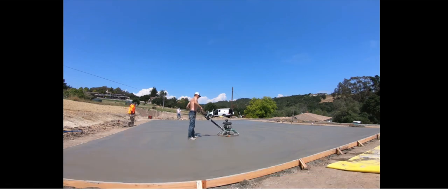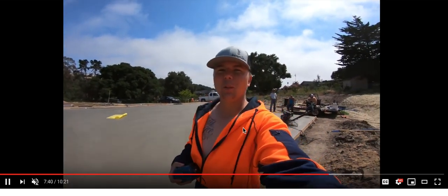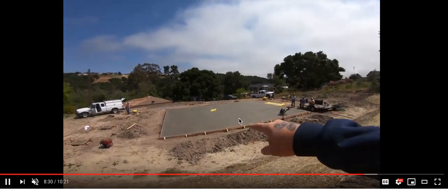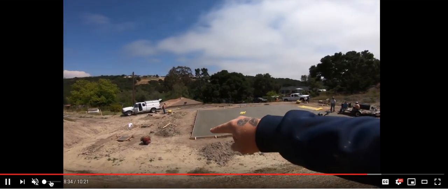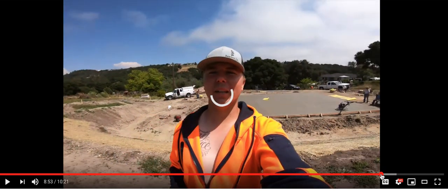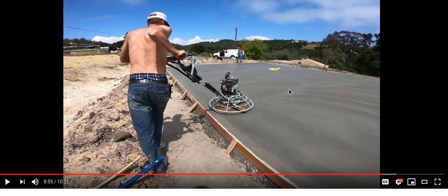At the very end, he's going to add water and trowel again. I'm like, whoa — what are you doing here? That's a good way to make it fail — give yourself a nice top that will shrink and fail. He looks like he's done, but he's actually going to spray water with a hose. After this step, he's now going to add water and start troweling again. It's not curing water that he's adding — he's actually delaminating the top, creating more paste and going at it again. Totally wrong step. All that happens is that water now has to shrink — it takes mass, it takes a place in this pad, it's displacing the cement. When it dries and evaporates, you'll have voids left where the water removed itself. This water is not from hydration — it's to help him just force a smooth finish, he thinks.